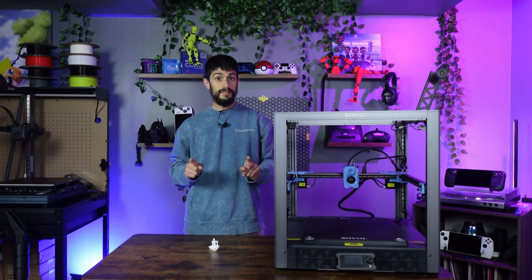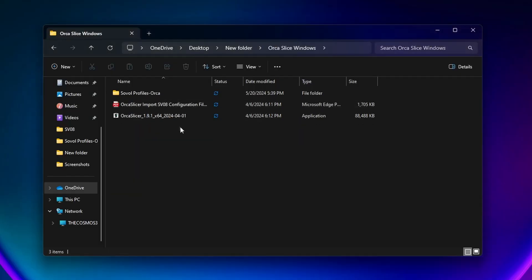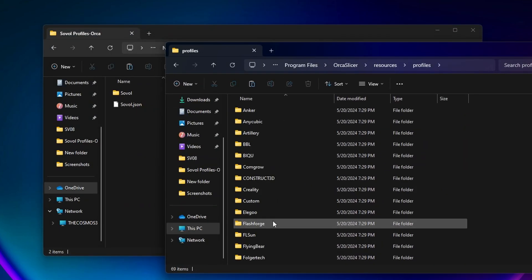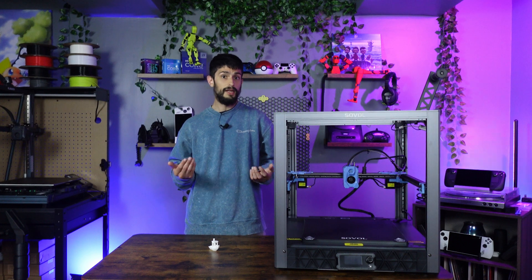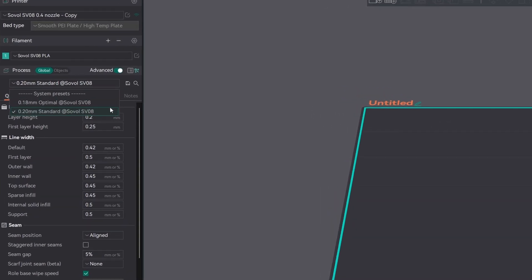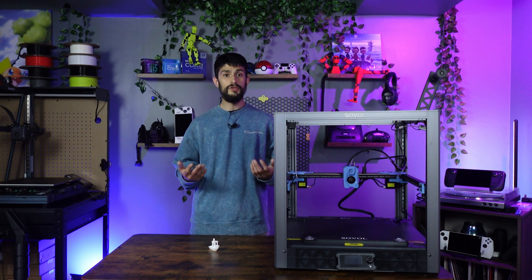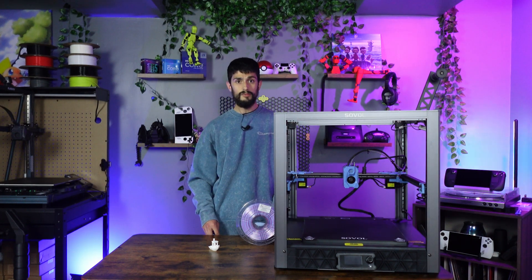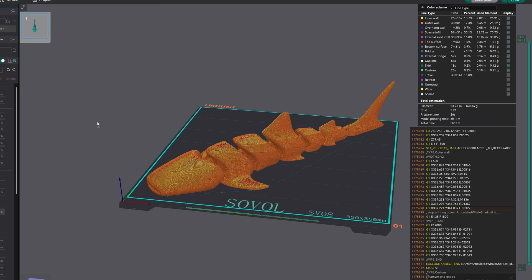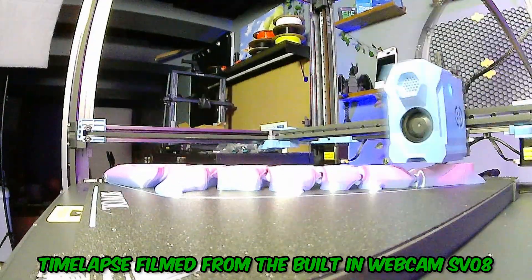I wanted to try my own filament, but since the machine is so new, none of the slicers have the SV08 as a machine yet. So either you install the included Orca Slicer on the USB they give you, or you can manually add the Sovol printer config files to your current Orca Slicer, like I did. Being so new, they only sent this with two different profiles — a 0.18 and a 0.2 quality. But hopefully, with the printer being fully open source, the community will make new ones soon. Once I got my slicer set up, I grabbed a roll of CookieCad's Silk Unicorn PLA, sliced up one of those articulated whale sharks — my kid loves to play with these — and started the print.